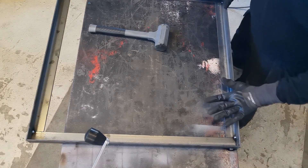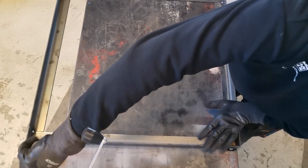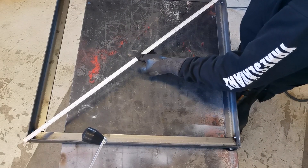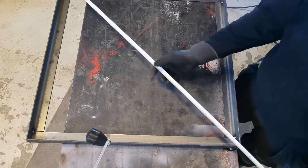Now that keeps this edge nice and straight. Just with a little tap — that should have removed it slightly. That's come to one meter and that's now at 993, so it's getting there.